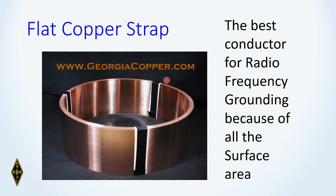So this is a coil of flat copper strap that you would take these pieces of tape off and then uncoil it. And you can mount it against the wall, you can bend it so that it makes turns around the corners. Flat copper strap is the best conductor for radio frequency grounding.